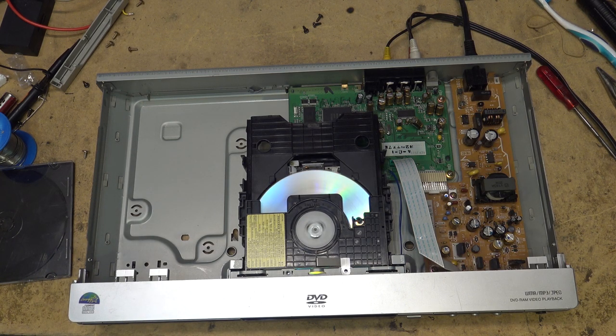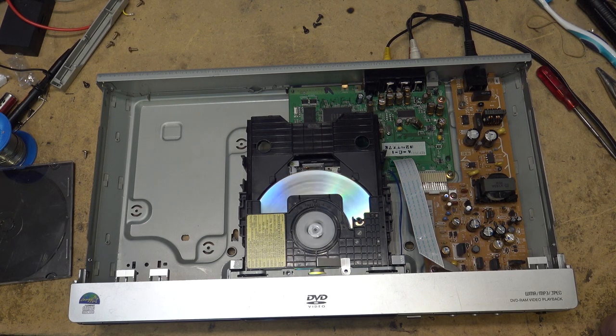This unit is now operational again. I didn't really need to do too much — just put about 11.5 to 12 volts onto the motor and spin it hard to get that motor behaving. More than likely the bearing was getting a bit gummed up, or the brushes were sparking and causing the speed to fluctuate so it wasn't locking in. But as you can see now it's working. Thanks for watching.